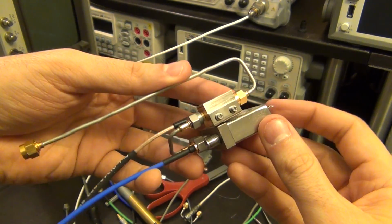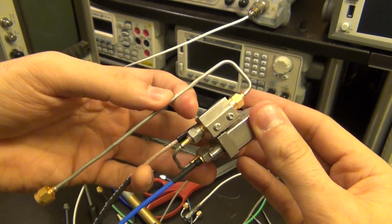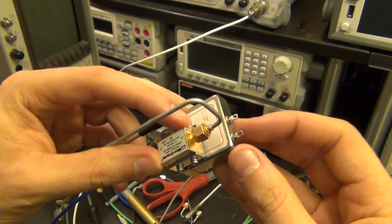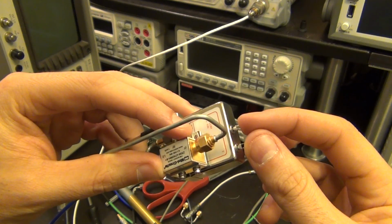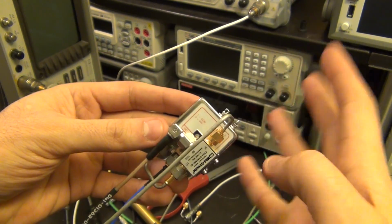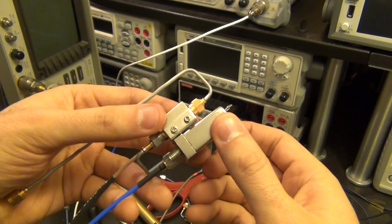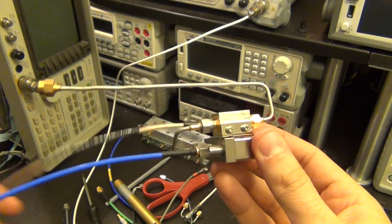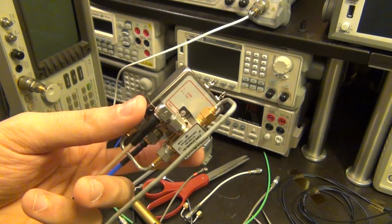And I'm going to do my best. I don't have enough rigid cables, and these things are very difficult to bend in place. Anyway, there's the inputs, by the way. You put 28 volts in here, it will switch to one side, and when you let it go, it will by default be switched to the other side. So that's what I'm going to use. I'm going to try and fit it inside the unit, and then hopefully when it's all together, we can give it a test and see if it all works.